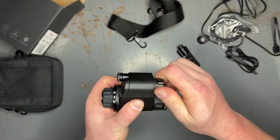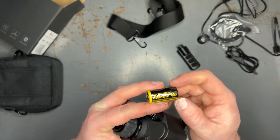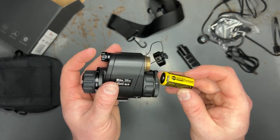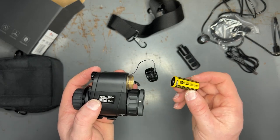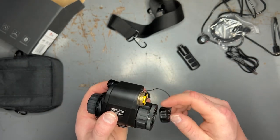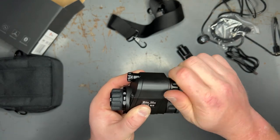I'll pull this one out so that you can see what I'm talking about. The battery life on this device with the batteries installed — the 650 milliamp 16340 batteries with the USB port right there for recharging — is only an hour and a half, so you don't have a ton of run time. You have more than enough to do a simple task, but having two of these come with the package was pretty nice, and the recharging feature is even nicer because you'd be burning through quite a bit of money if you were trying to use CR123s in this long term. So that's a nice addition that came with the packaging.